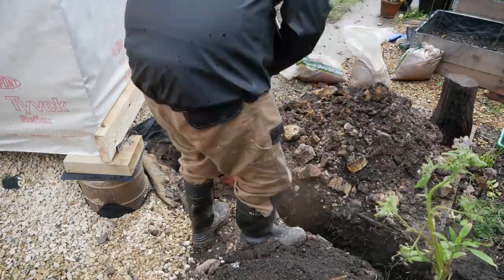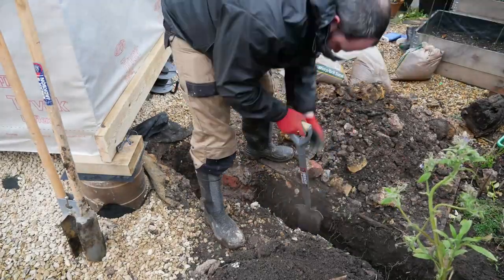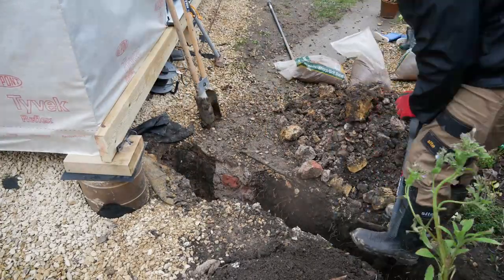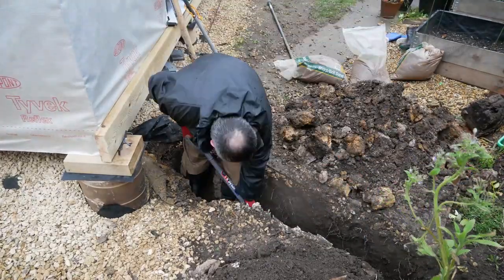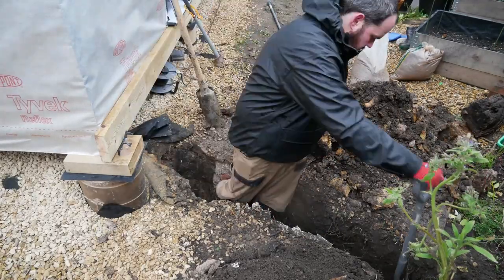The biggest task was the laying of the armoured cable from the house to the office itself. This required a trench to cross from the edge of the garden to the building itself. This needed to be 600mm deep, and I elected to use a large conduit pipe to facilitate both the electrical and data lines, with the ability to run anything else I want in the future.